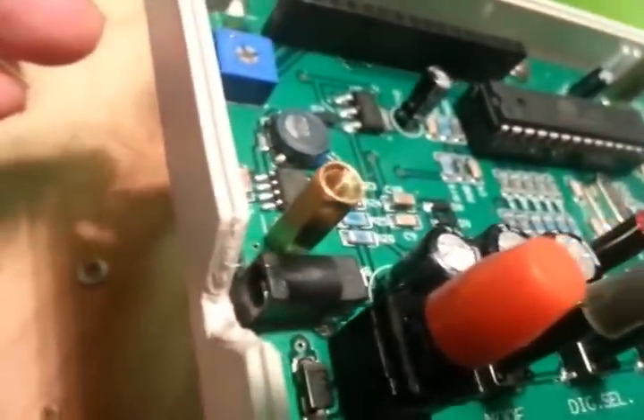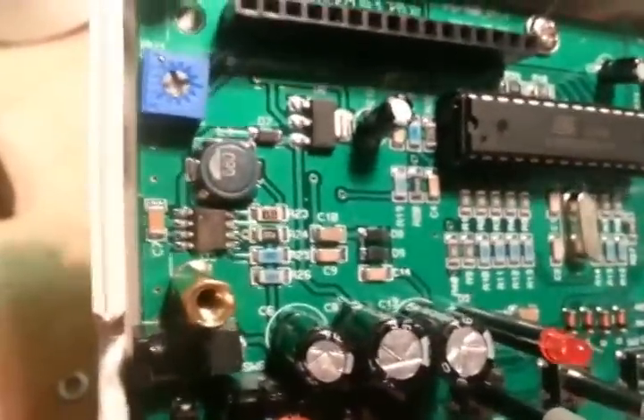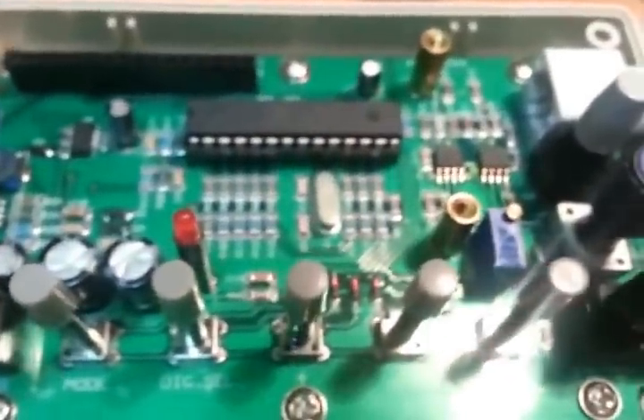This adapter was kind of a weird size barrel. Notice that there's no voltage regulators or anything — these capacitors might be used for filtering out a bit, but no voltage regulator. So you've got to put a 5 volt power supply on there. If you wanted, you could build your own little thing and put some kind of voltage regulator in on your own. You could mod it, make it do what you want, and it was cheap enough that it's not really a huge deal anyway. So there you have it — the FG-100 DDS function generator. For the price, it was a pretty good deal. If you just want something to play around with, sure, go for it.